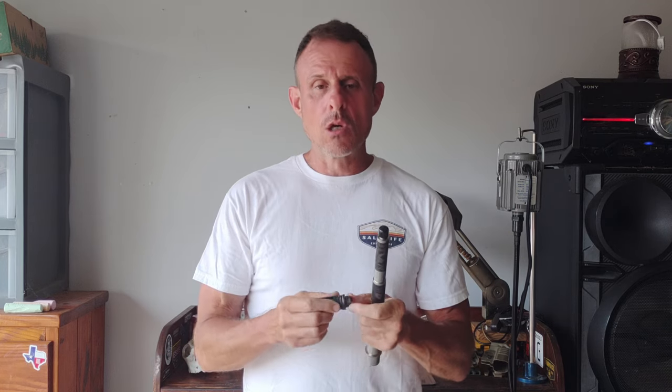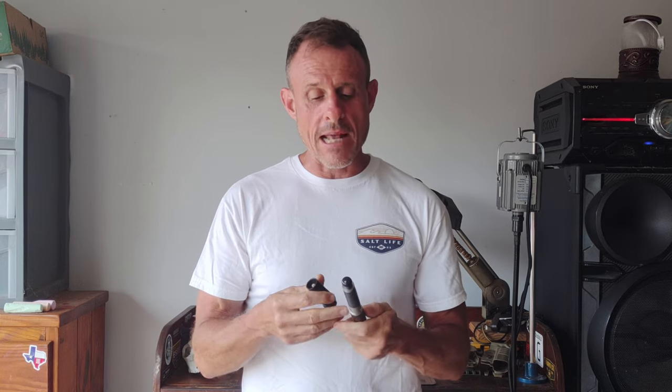On my own research I had started to determine what happened, and that's something called cold welding — or you might refer to it just as galling. Cold welding is when two surfaces rub against each other of the exact same type of metal and the heat from the friction causes them, on a microscopic level, to literally weld together. I had also watched a video on School of the American Rifle — great channel, really in-depth — and in that video he tests the threads and speaks about class one, class two, and class three threads.